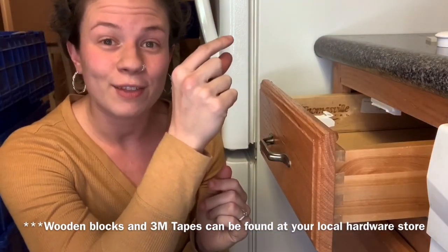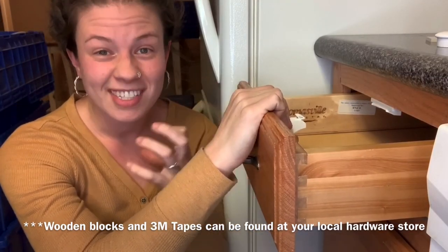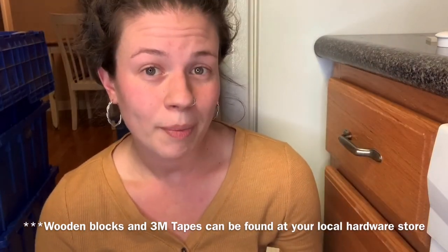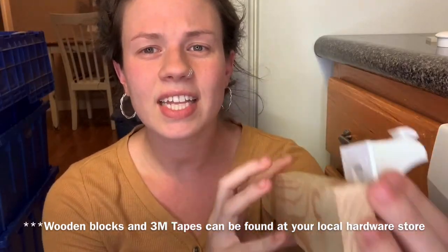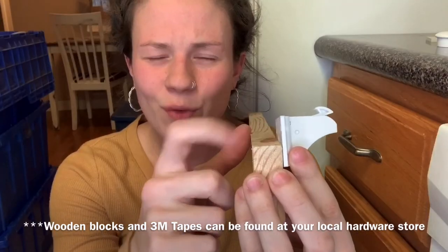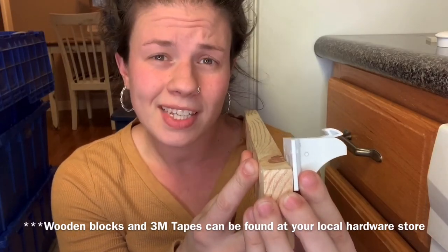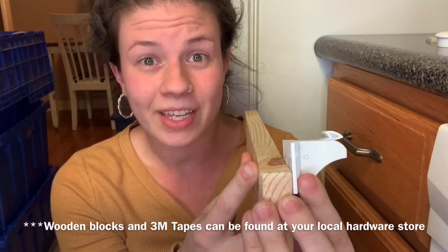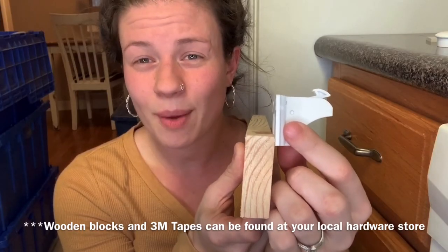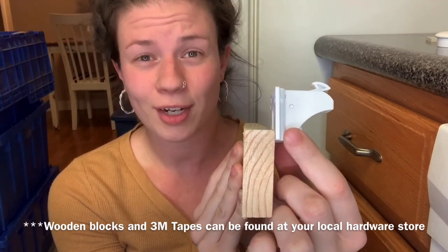Now because I've brought the height of the strike down, my lock is fully seated on the drawer body and I don't have to worry about whether it's going to get ripped off. An easy way to tell which solution might work best is to see exactly how the lock is lined up on the drawer body. If about half or less of the lock is showing above the drawer body, go with solution two — it's less to work around long term. If your lock placement is just barely catching the top of the drawer body and can't clear it, go with solution one, because that might be too far to shim your strike plate down.